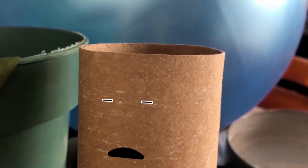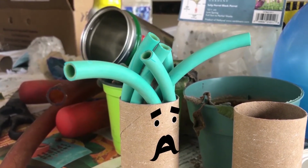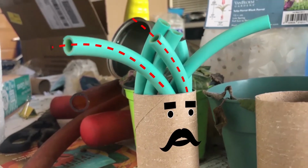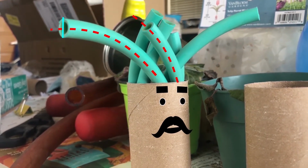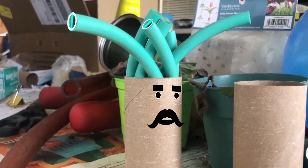Come on, spit it out. But what about a complicated bendy hose or something? No problem. Just sketch the center line inside the bendy hose. And where you want your end, just draw that line at 90 degrees. And bingo, old boy, there's the long side of your ellipse.